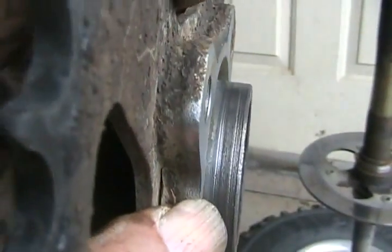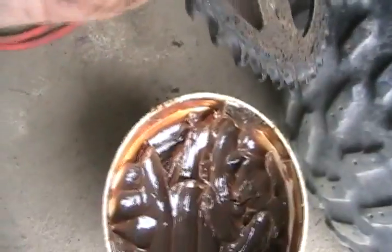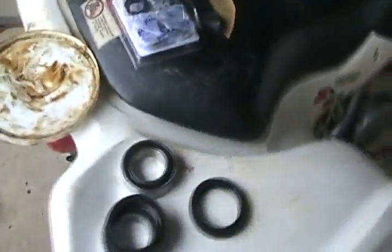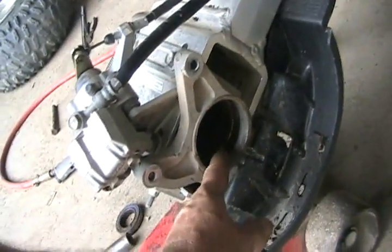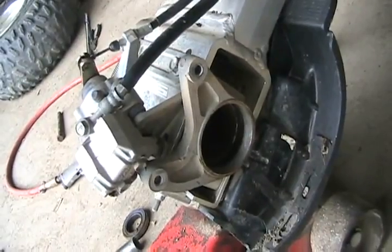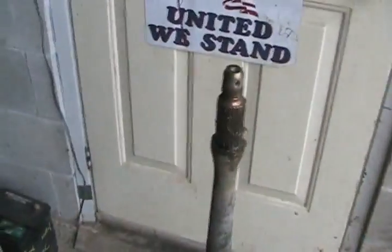It's very important that the surfaces the bearing slides on are clean and free of rust and debris, so I sanded and wire brushed the bore surfaces. Now I'm going to put a little bit of grease on, and it's also best to put a little bit of grease or oil inside the edge of the seal too - a dry seal can burn out in one day just rubbing on bare metal. I've cleaned out the hole, cleaned up the spacer, and I'll smear some grease in there. I even like to put a little grease on the bearing's fitting surface just to help it slide in easier. It's very important to grease all the splines because water gets in between those splines, erodes them, and one day you might not have any drive because the splines have chewed themselves right off.